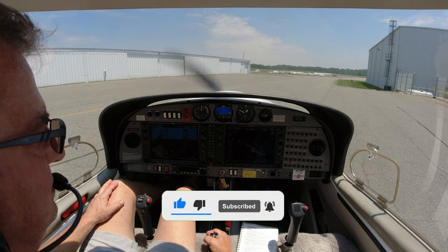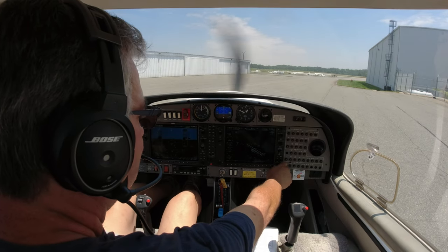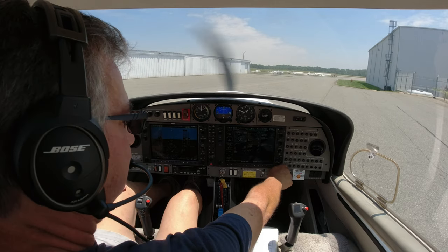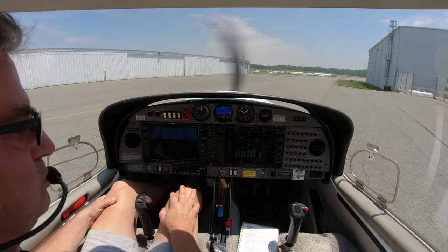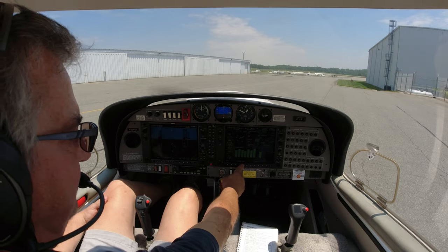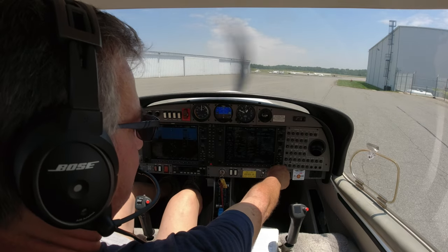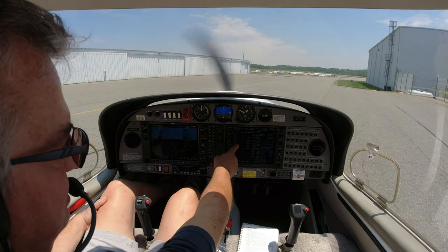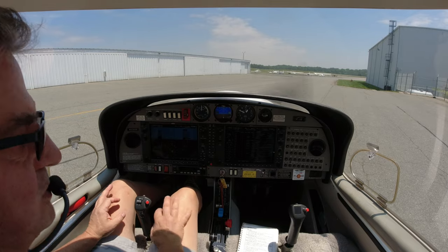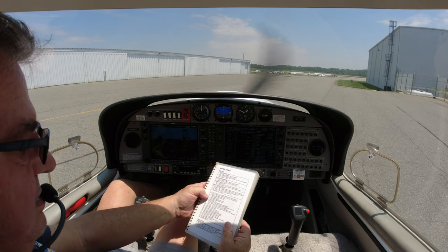We slow the engine down to about 1,000 RPM for idle. Then we go to the auxiliary chapter on the G1000 and check our GPS — GPS 1 has plenty of satellites, GPS 2 also has plenty. An item not in the checklist: go to the last page of the aux chapter and make sure all check marks are green. Occasionally you'll get a red GDL 90 failure — that's a traffic device failure and you'd need to reset the transponder breaker to fix it. We follow traffic on short final while going down our list.